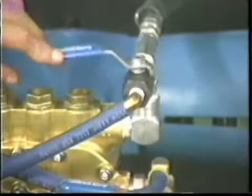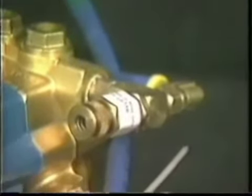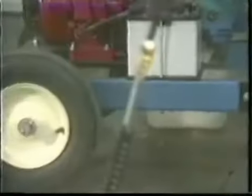The outlet drain hose — water will drain from this hose whenever the outlet valve is open. If you are jetting inside, use the five-gallon holding tanks to collect this runoff. An outstanding feature for pump longevity is the high-temperature dump valve. This valve automatically releases hot water from the pump, drawing cold water in to replace it, and opens periodically during use with the wash wand.